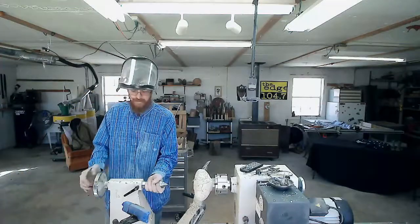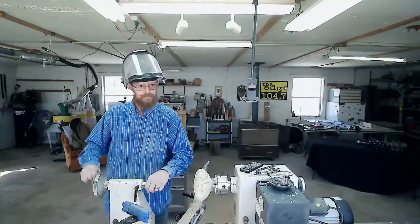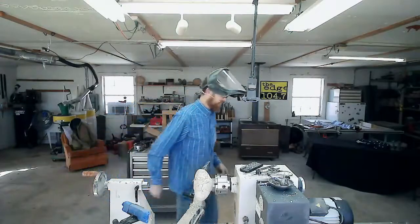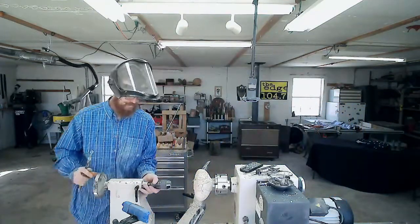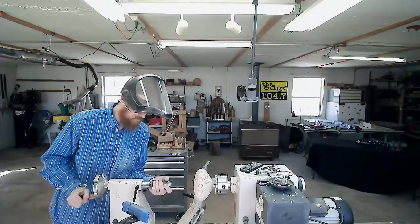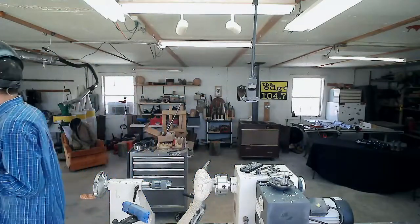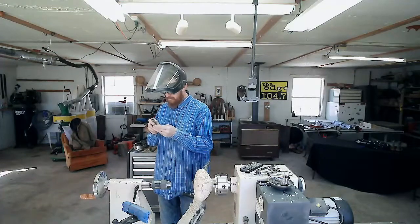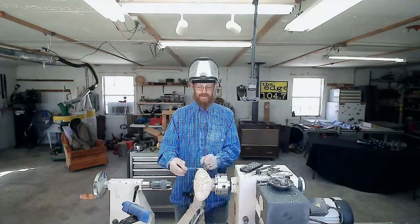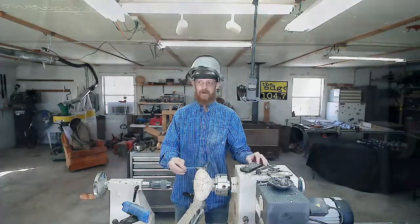Okay, we got to take our live center out. Okay, we can use the tape that's on here, and we'll use that to give us the depth that we want. Well, it's not coming off very easy. We want to leave enough on the bottom so we're not going through, about 1/4 inch or 3/8. And it looks like the tape's just about right there.